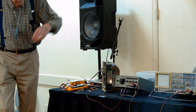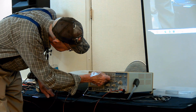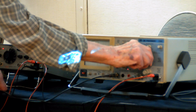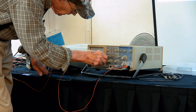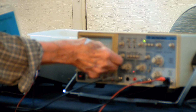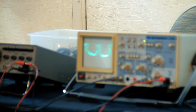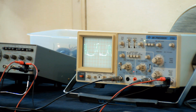You can look at that waveform right there to channel A. So we'll go to channel 1, go with that frequency. AC is good. There's some 60 hertz stuff there. That's some of the buzzing. So a local oscillator doesn't look like it's operating.